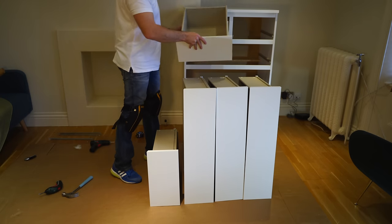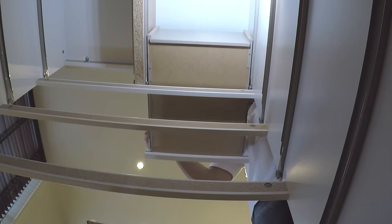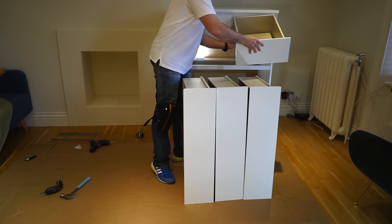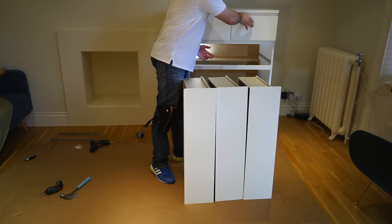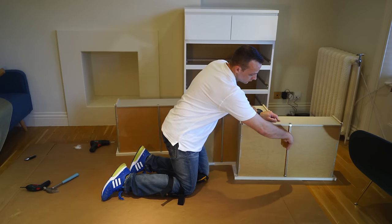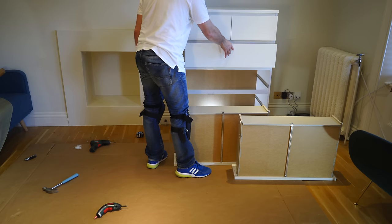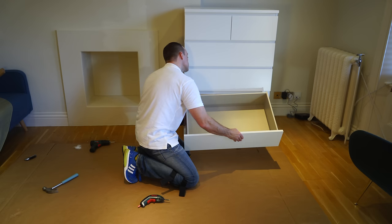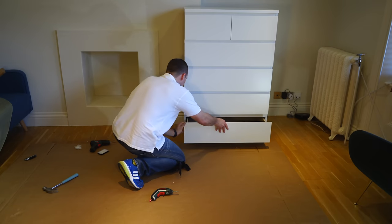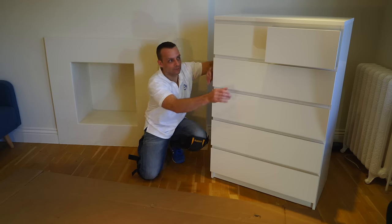Now we can place the drawers in. Start the wheel — you're going to have to go over the wheel, so put the drawer a little bit lower to go over it, then lift the drawer up and slide it in. It's going to be very tight. For the bigger drawers, place the support in and do exactly the same — push the drawer a little bit down, go over the wheel, then lift it up and slide it in. It should be nice and smooth. If it doesn't go in easily, you may have done something wrong — check how the rails are positioned. And this is it — this is the IKEA Malm 6 drawer chest. I hope you enjoy it. Thank you for watching and have a fantastic day.